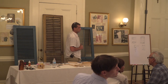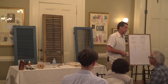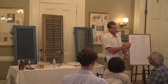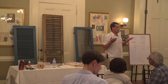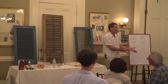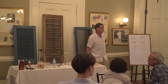What about shutters that are not painted — just a sealant on them? Is that risky? It's a ridiculous amount of maintenance to keep a clear finish. Normally a spar varnish or marine varnish looks good at first, but it's just attacked by the sun and the water. We have stained wood on the front of this restaurant and it is a nightmare to try and keep that looking good. It wasn't historic and I wouldn't recommend it, because it's just a lot of work — though it does look nice.